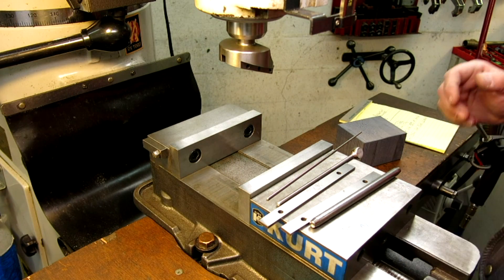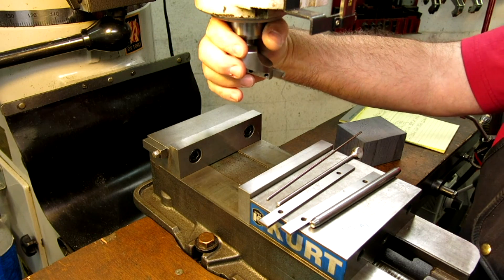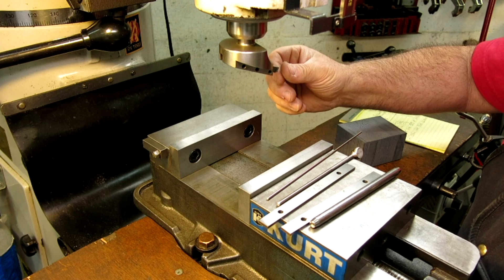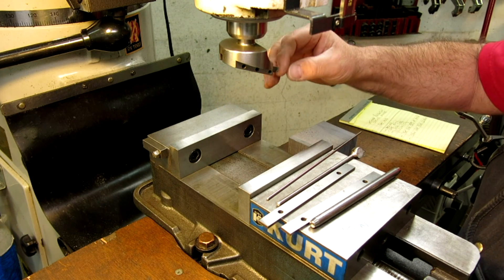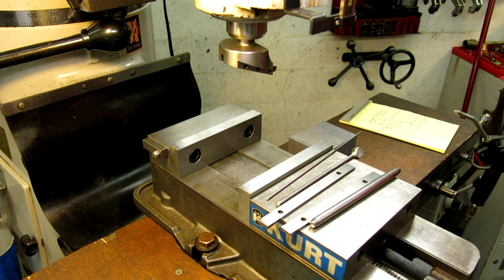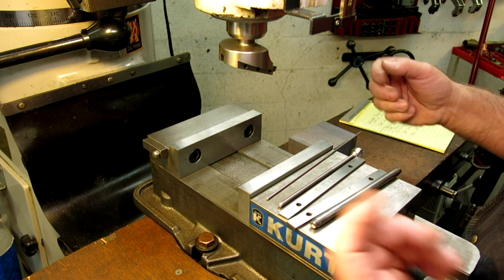Let's get set up here. I decided I'm going to use the fly cutter because it's a tool that's pretty much accessible to anybody. If you don't have a fly cutter, it's a really nice tool to have — you can cover broad areas in a single pass and you can adjust your tool geometry for different materials. So it's just a handy single-point cutting tool. Let's get going.